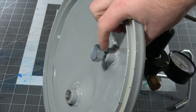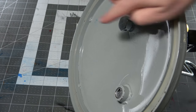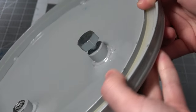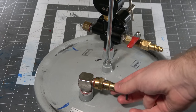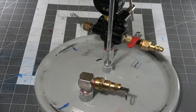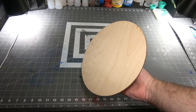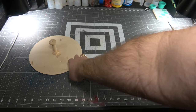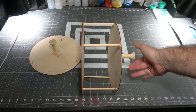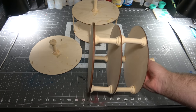It typically has a long metal rod that puts the pressure down in your paint, but I took that off, and instead we're going to use this air inlet here, which I like leaving on there because it prevents the air from going straight down and sprays it out the side instead — so it's not shooting right down into our resin and possibly making a mess. It also has the safety valve here, which won't let the pressure pot go above 45 PSI. If it tries to go above 45 PSI, this little spring will pull out and all of the air pressure will be released until it's under 45 PSI — one of the most important components.